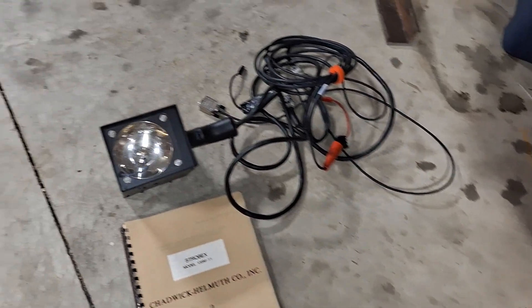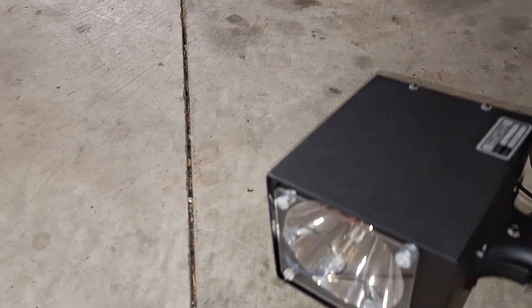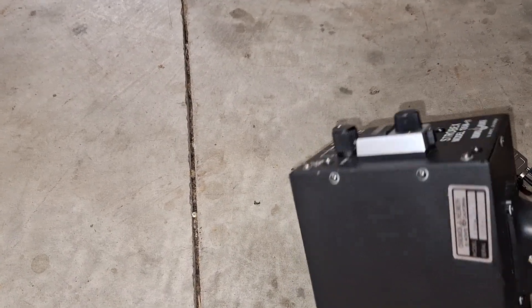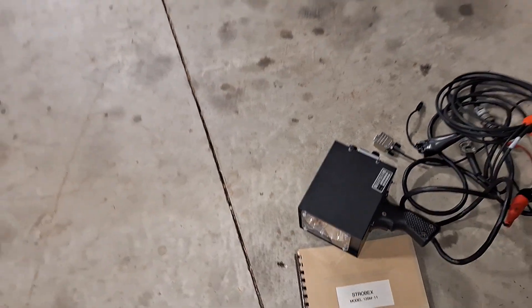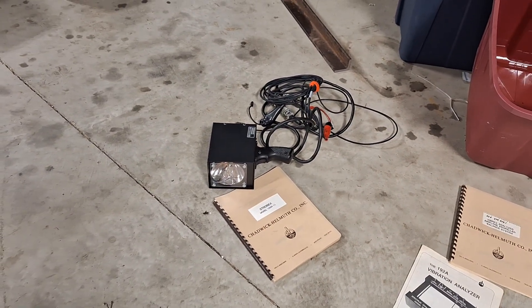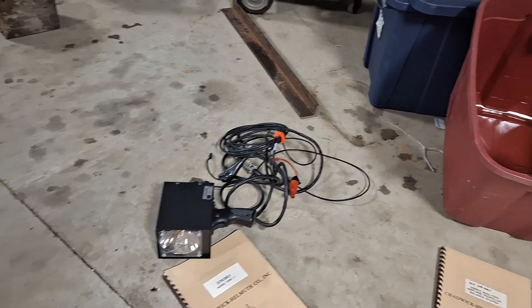So I'll just show you some of the equipment. This is the strobe you use when you're tracking and balancing blades on helicopters. You used to have to use this on everything — you used to have to stop the blade to know the azimuth. Nowadays we're using photo cells and magnetic sensors.